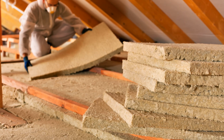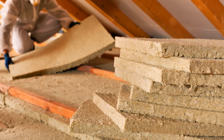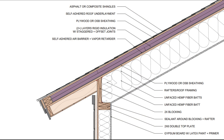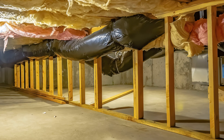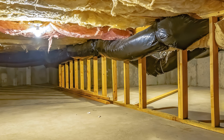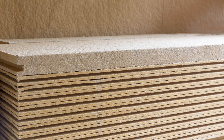If you're installing hemp fiber batts in the ceiling and it's a vented roof, that's fine — just vent the roof and provide your air barrier at the ceiling plane. If you're building a conditioned roof using hemp fiber batts, treat it exactly like mineral wool or wood fiber batts: you need rigid insulation outboard or a smart vapor retarder on the inside to prevent condensation on the backside of that sheathing. For the crawlspace, it depends on whether it's conditioned or vented. Overall, I don't inherently see an issue with it — feel free to use it.